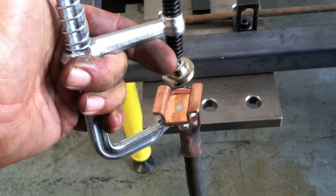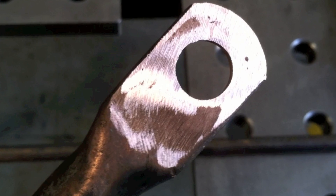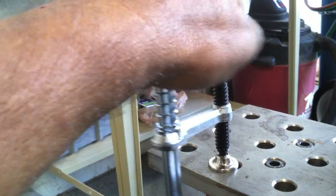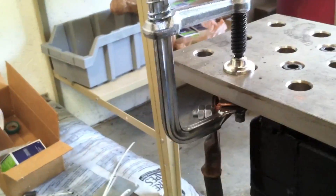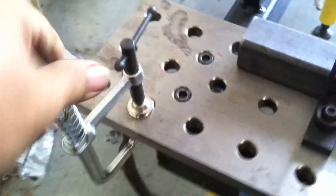I offset the slats here to give me a little bit more width — it's another option. Before I start tack welding, I'm going to replace this chintzy ground on the welder. Welders don't come with very good grounds these days, but I'm replacing it with this good one. Stronghand makes that one — it's got a copper jaw on it. I shined up the end to knock the oxidation off, bolted the crimped end onto it, and it's a one-handed spring-loaded clamp. The table slats are bare metal, so I'll get a good ground there.